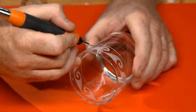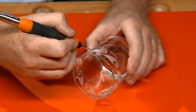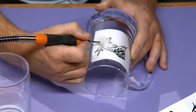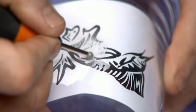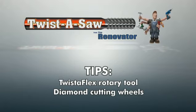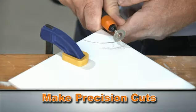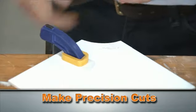The kit includes 10 diamond drills for masonry, glass, or ceramics. When etching glass, choose the bit to suit your job, select a medium speed, and use it just like a pen — no heavy pressure is needed for a professional result. The 22-millimeter diamond cutting wheel will cut masonry, glass, and ceramic. As with all diamond bits, never force the cut — find the correct speed and take your time.